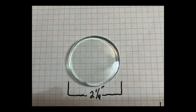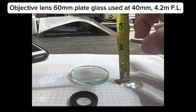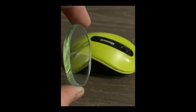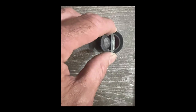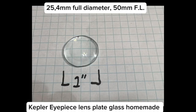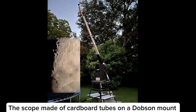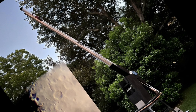Zookeeper Game on Reddit made a very long telescope by himself using plate glass, ground by himself — 60 millimeters in diameter, ground and polished by himself. The actual aperture used is 40 millimeters and the focal length is 4.2 meters long. The eyepiece is 25 millimeters in diameter and 50 millimeters focal length, also plate glass — only two lenses total: one objective lens in the front and a single plano-convex lens at the eyepiece. Mounted on a Dobsonian mount, this huge cardboard tube telescope is mounted on a board and on the Dobsonian mount, all sitting on a table.